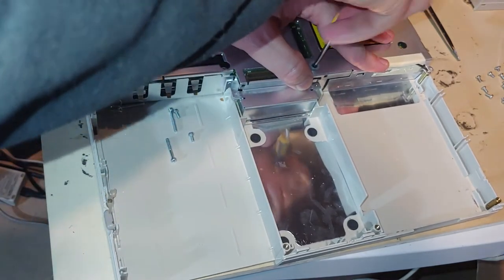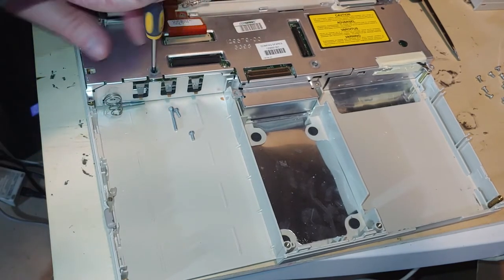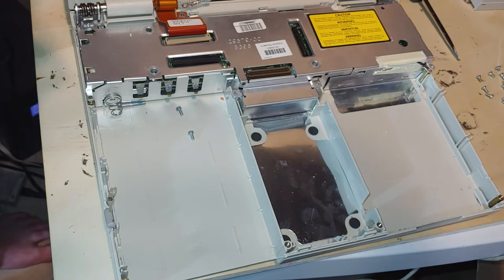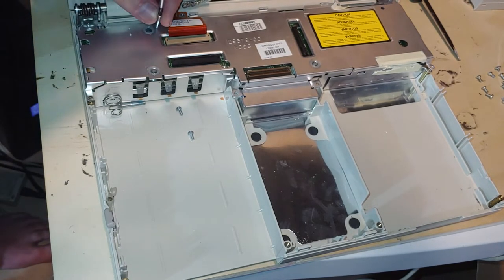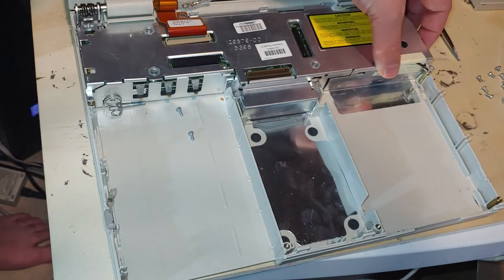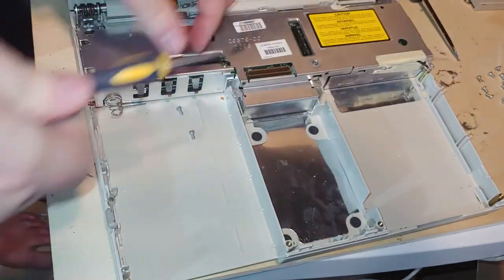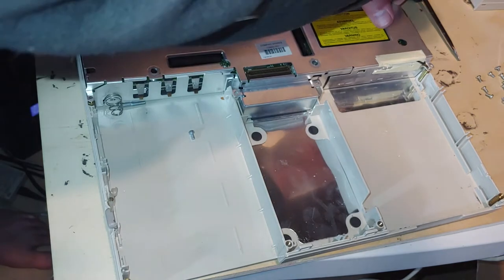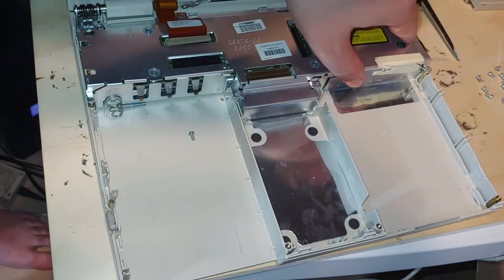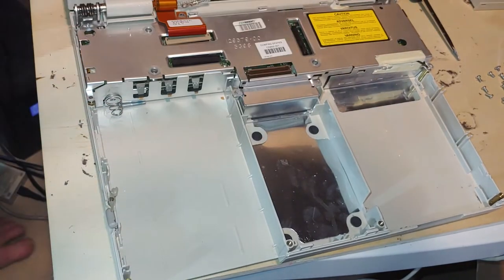And I probably should have cautioned you in the beginning on this, but I will show you this when we have this computer back together. There is one critical feature that you need enabled. You'll be able to see it in the BIOS, but you can't change it in the BIOS. There's a piece of software that Compaq installed on every one of their machines out of the factory that you'll need to change this setting out of. But we'll cross that bridge when we get there. I'll show you on another machine what that software actually is. I don't know if the Compaq had anything for Windows 95 with it, but I know it came on 3.1 machines for sure.